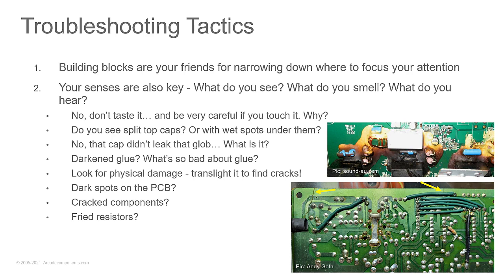That's one thing that I've done over the years in checking arcade game boards: very carefully touch things. I've gotten to where you just barely do it, using the back of your fingers because that's your most sensitive part, and you run it over the chips like this. But if you get a shorted RAM, it doesn't take but maybe 5 seconds for that thing to get hot enough to blister your finger. And then all of a sudden you have a big blister on the back of your finger. Just ask on the local retro computing group how many people have gotten blisters from hot chips. It's painful, and it will be a reminder for about 2 weeks as it heals.